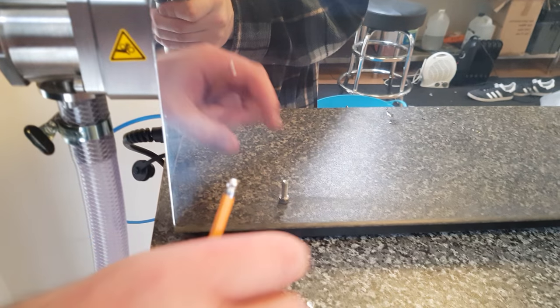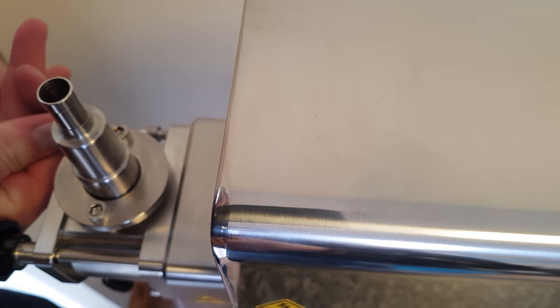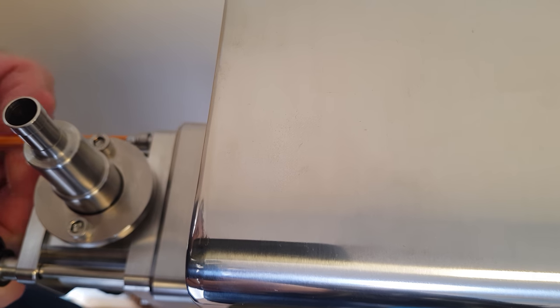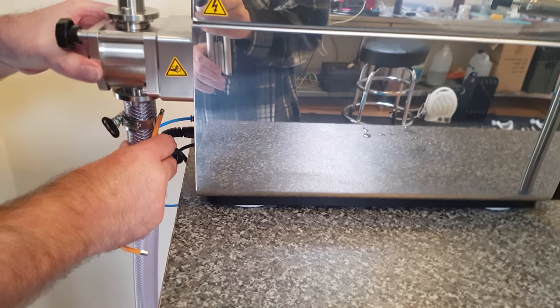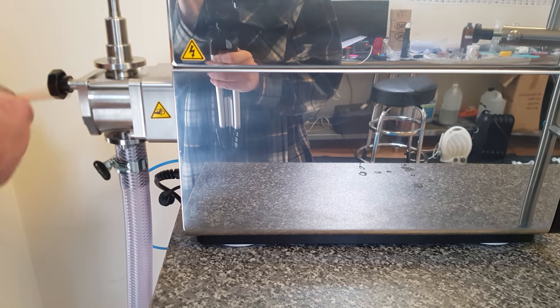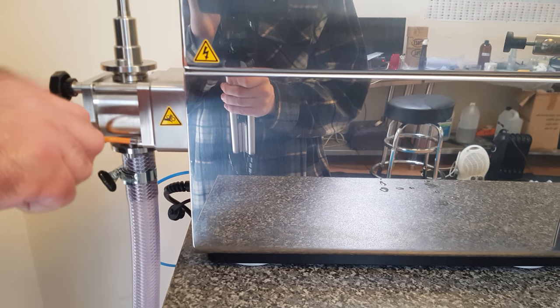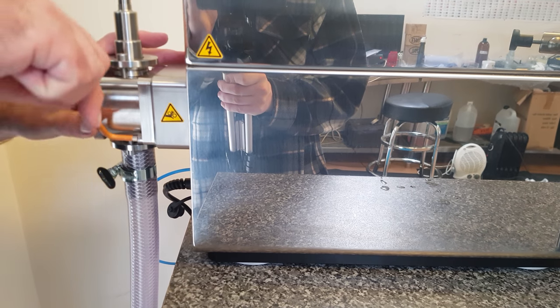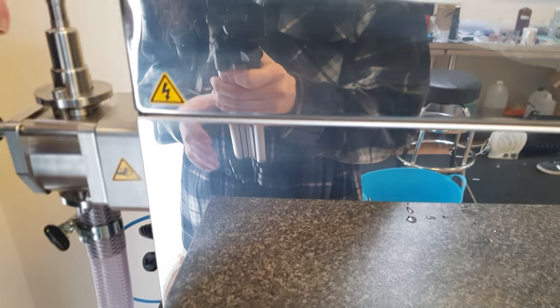Once one's in, you're okay. And the top one. Make sure it's lined up — it sits on the precision boss so you can't not get it right. Then just give that a little torque, you don't have to over-tighten this. Just use the torque on the 5mm key.